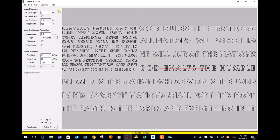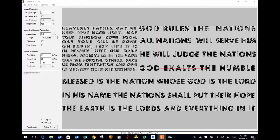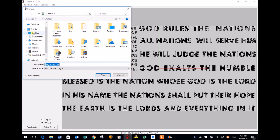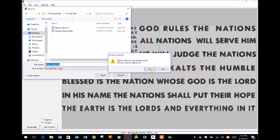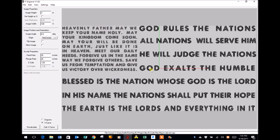I can now close the settings box and calculate the V-carve. Once completed, you'll notice the appearance of the lettering has changed — the black lines indicate the material that will be removed and the white lines indicate the tool path your bit will follow. Once this step is completed you're ready to save the G-code file. I highlight the File tab, select Save G-code file, navigate to my project files folder, and save it.